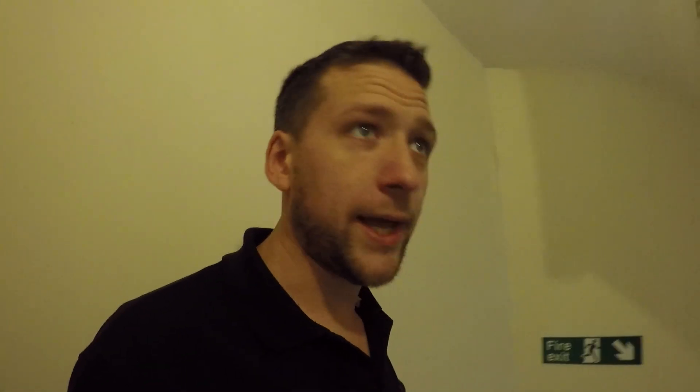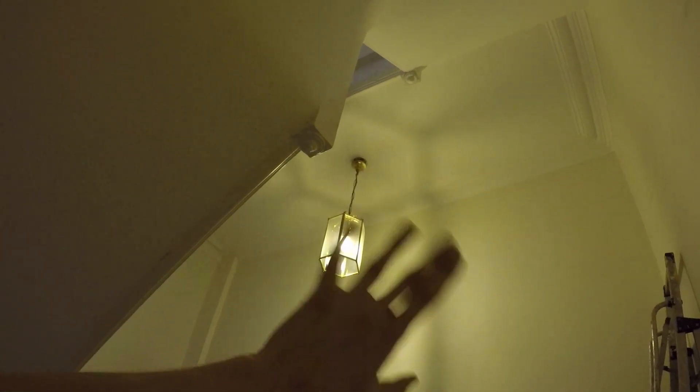We can either put a light fitting up there or just replace that one. This is solid but that there is a stud wall. So again we'll need a light fitting with an emergency light built into it and a smoke detector up there — that's the top floor. This is the first floor here. We might want two bulkheads here — that would look a bit better, or one bright one and another. Maybe one there, one there perhaps. We need smoke detection up here.